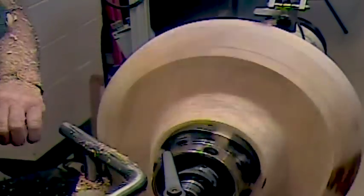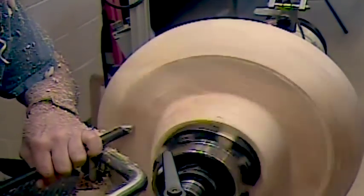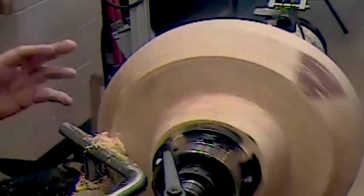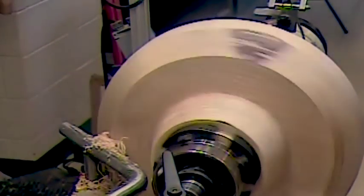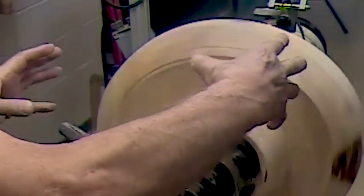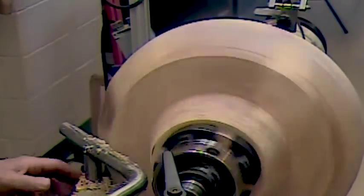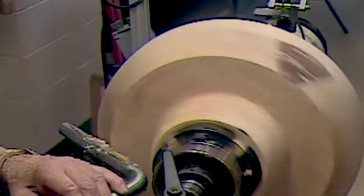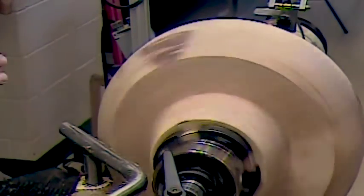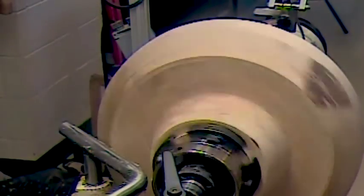I make that fairly smooth because I want to put layout on there. When I make a mirror ring, I've got to make them in 9.5, 10.5, 11.5, 12.5, depending on how much I've got to work with. Specific sizes, because then I can buy a specific size mirror and make a frame to fit 10-inch, 11-inch, 12-inch, 13-inch glass.